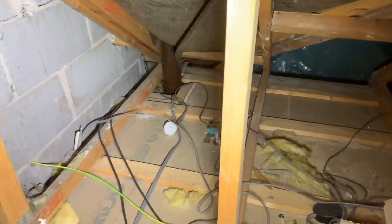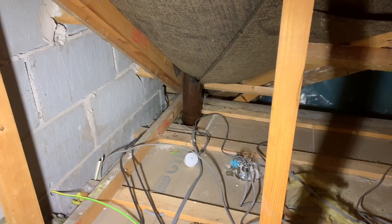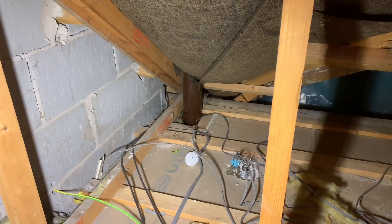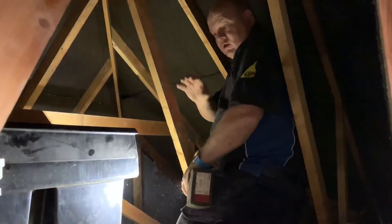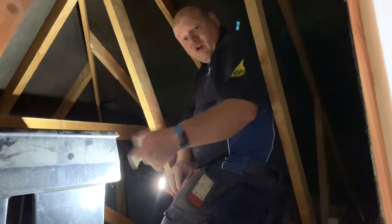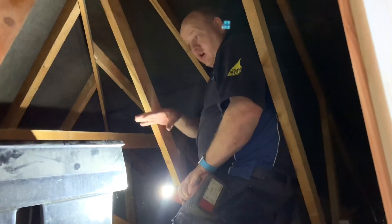Just while we're in the loft — you can see a soil pipe in that corner. We know there's some boxing in down in the garage, and that pipe goes down there, so rather than put the condensate outside we may use that soil pipe. We're always thinking ahead about the rest of the job. I've disconnected all the tanks, cut all the pipes with no elbows on, so when we go below and cut the pipes I can just pull them down without damaging the ceiling.